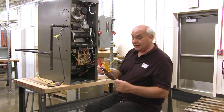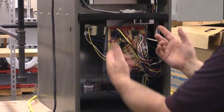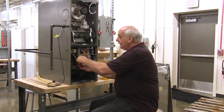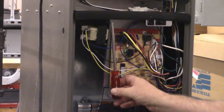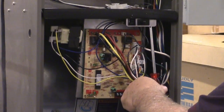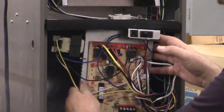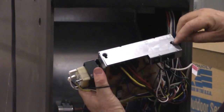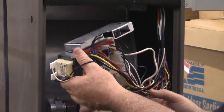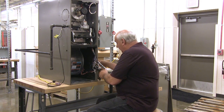These two tools alone will do just about everything. The first thing I want to do is take this board out of the way because I want to pull this motor out. Up under here are two screws that hold this bracket in place. I'm going to take the quarter-inch nut driver and loosen that screw — we don't need to take it all the way out — and on this side we will loosen the screw as well. By sliding this plate forward it will unhinge off of those screws. This is a circuit board and transformer, so we are just going to move all of this over to the side of the furnace and lay it down.